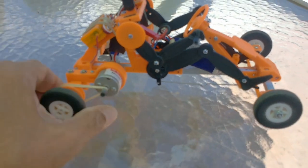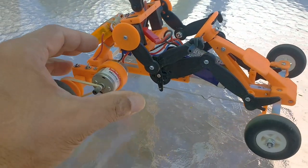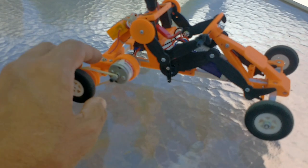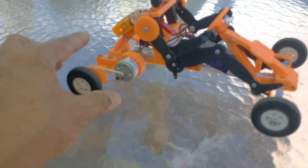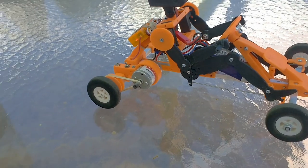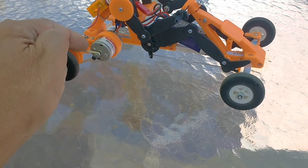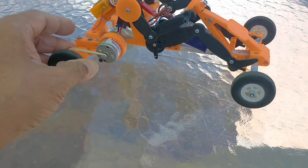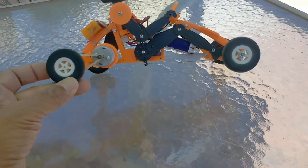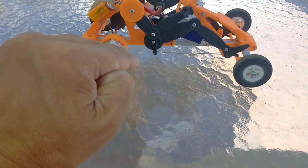So this is to show the latest mods and upgrades that I've been doing. Not necessarily upgrades, because these are things that have to be done before I release the product. But I changed the motor bracket here. I had a very stocky motor bracket before, and it was vertical. It was two pieces. There was one that provided the vertical framing or support for the motor, and then it had the motor clamp as a separate item, and you could change the distance just to make the belt drive a little bit tighter or looser. But this pretty much does the same thing, except that I've cleaned that up, and now it's only one piece and it's horizontal. It's more streamlined or in line with the base, so it's very low profile too, so it keeps the motor from up here where it was before to more in line with the base.